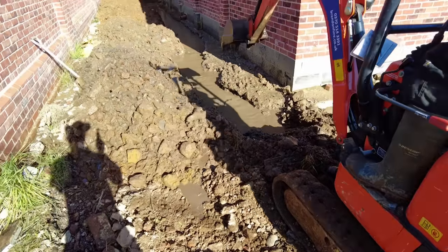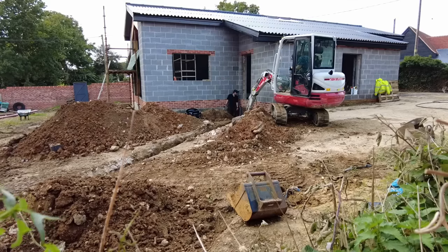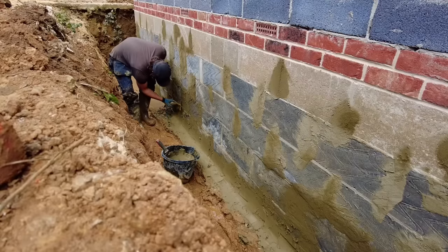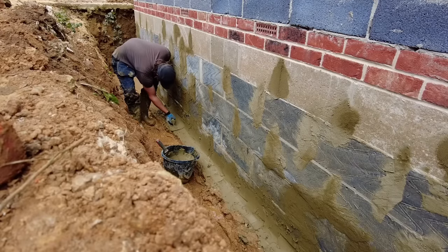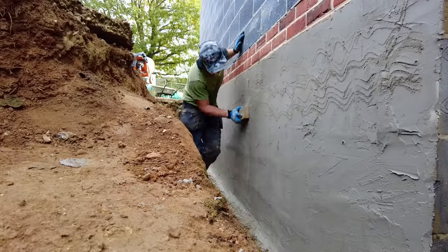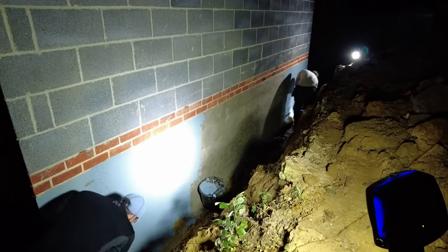That wasn't helped by me not having gutters. I still don't have gutters, but I knew it was going to be a problem and it was something I had to tackle there and then. I proceeded to dig out my full foundation all the way down to the actual trench fill, exposing all of the trench blocks, then cleaned everything off. I put a concrete fillet at the bottom of the wall at the junction between the trench blocks and the foundation, then used another product to flatten off the wall and give it a key, and then put on something called MB2K — a flexible tanking membrane.